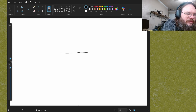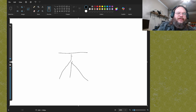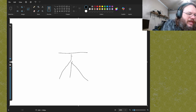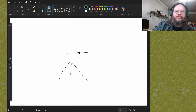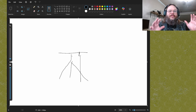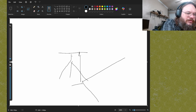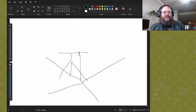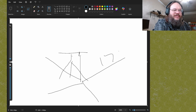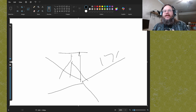We got the Skyhook and it comes out to the tripod, and we need a ground for this. We're going to be building a little wire that connects to the metal part of the Skyhook, comes out and goes straight to the ground, and then we're going to attach four wires — one, two, three, four — and that is going to be our grounding system. These wires are going to be 17 feet so they should handle up to 40 meters. More wire is not going to hurt the counterpoise.